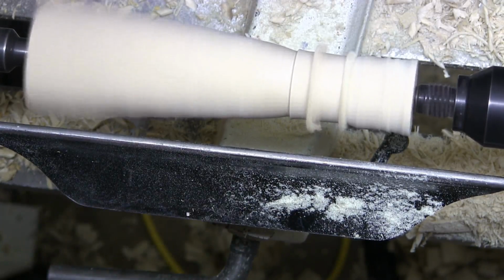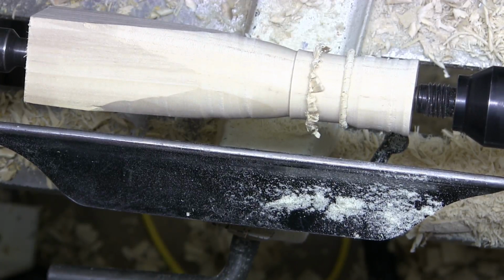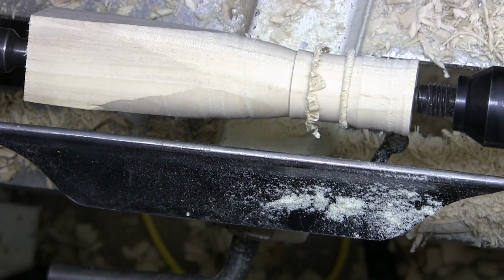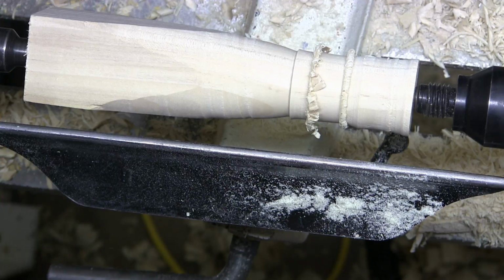How much support do I have on the tool? How much is very little? Not enough? Maybe an 1/8 if I really push the envelope, but as soon as it crosses, ooh, you see how diameter figures in now? What if I have a 10-inch bowl and I'm going to take my skew and plane? Just the tangent of hitting the bevel, raising the handle to engage, may push it right into a dig-in immediately with violence in a bowl.